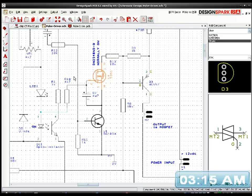But it will still receive signals through the 10K up here. The signals will get exponentially larger and larger as the circuit speeds up, but any voltage that's on this line will simply go in the base and out the emitter directly to ground. Absolutely nothing can travel back up here because this MOSFET is off, so it's not going to interfere with the circuit. It's completely isolated now. It's basically in its own little zone.